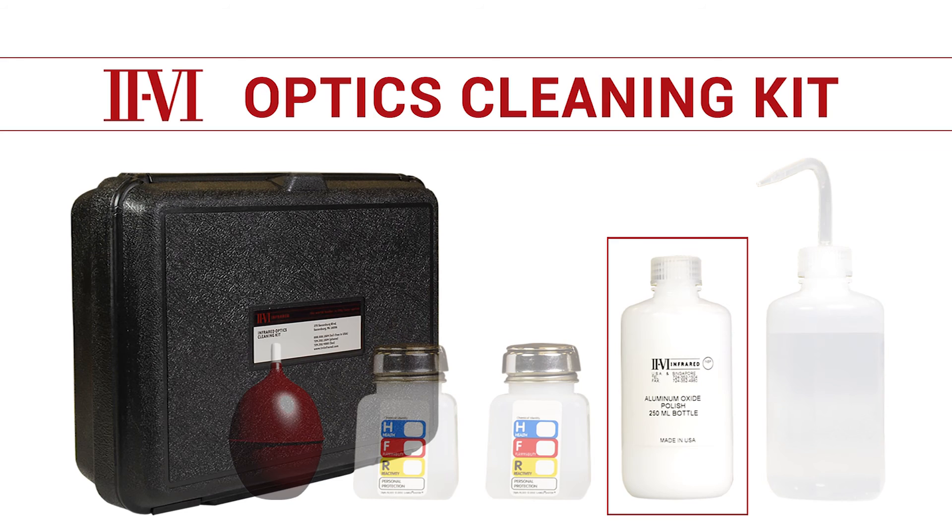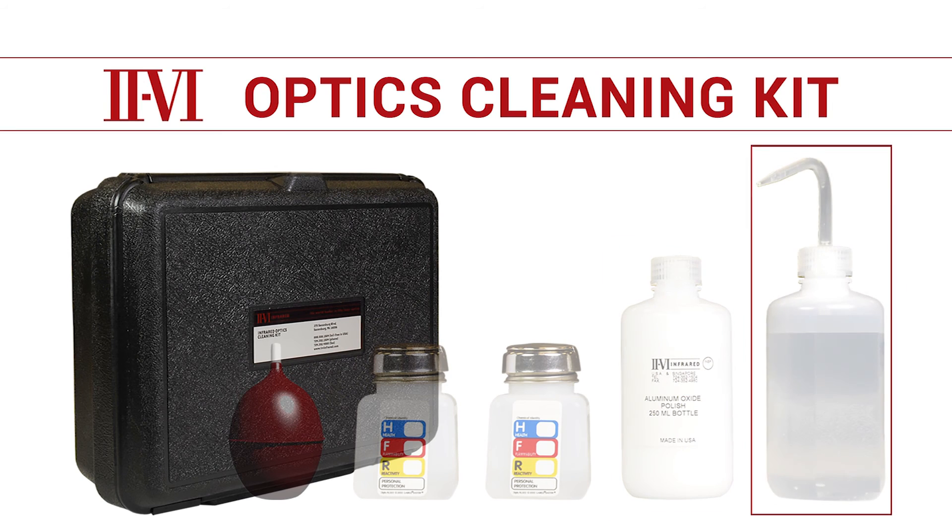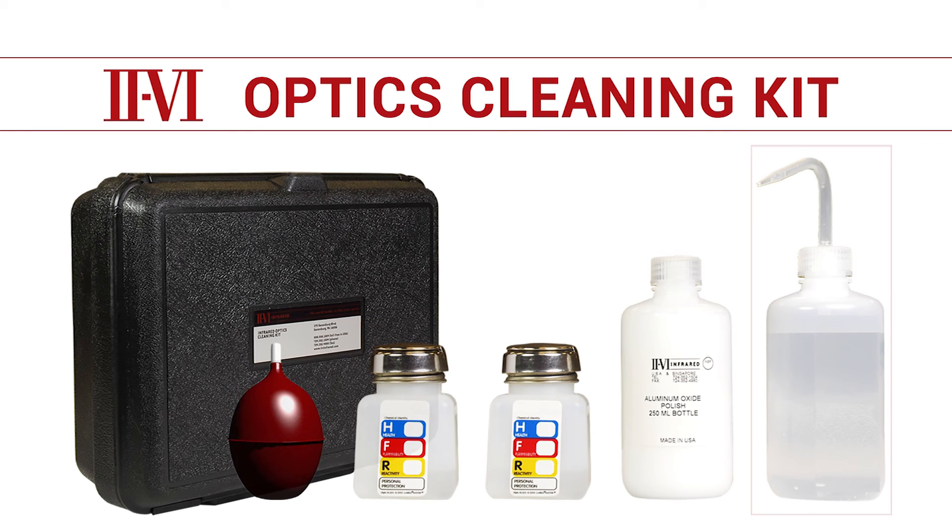The two other bottles are used for more stringent and aggressive cleaning, recommended only on severely contaminated optics. We have aluminum polish here — a liquid white polish used in abrasive cleaning steps. We also recommend distilled water. The important thing is not to use tap water or commercially available water from your water system, as it may contain dissolved solids or trace materials that could contaminate or scratch the optic.